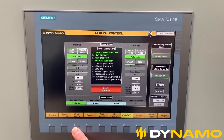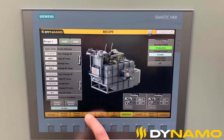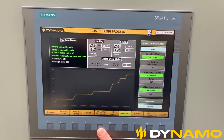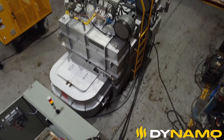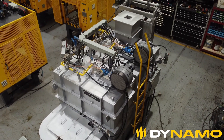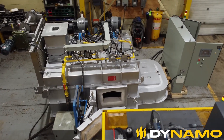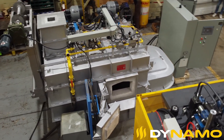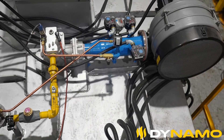Less drop in temperature means a more consistent temperature, which translates to better quality castings and less scrap. Our dry hearth furnace consists of two distinct chambers equipped with two burners, two air blowers, and two autonomous heating systems. It effectively minimizes the production of oxides and significantly diminishes temperature fluctuations that occur during the charging process.